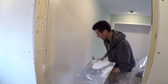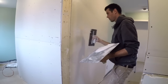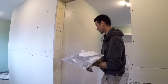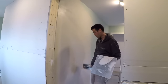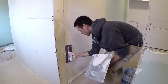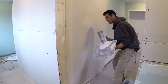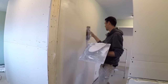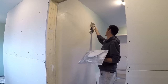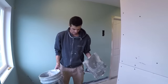Now I'm doing the exact same thing as the last coat — angling my trowel so my first pass I'm just loading it on, then I angle it so all my consecutive passes leave a decent feathered edge and don't get a nasty line in my work. All this going over it is just leveling out any inconsistencies. As I said with the wall maker concept — we're not just coating these little patches individually, we're making a whole new surface of the wall. That's how you get them to all disappear and not wind up with a wall full of little molehills. I'm almost at the point where I'm gonna walk away and wait till my final coat.